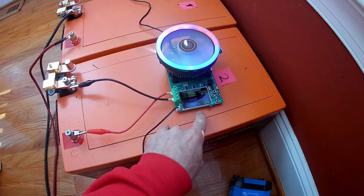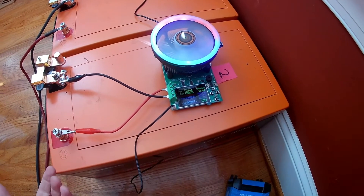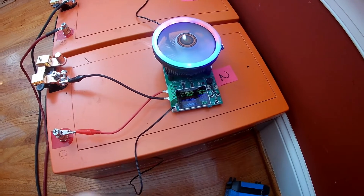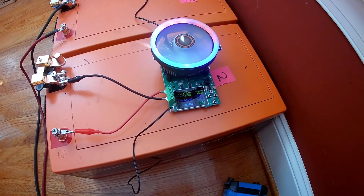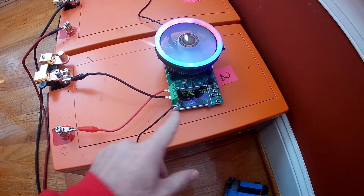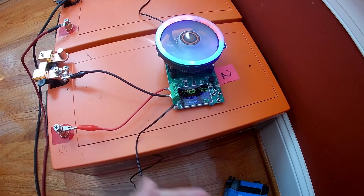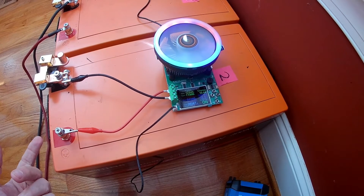This is battery number two and I'm just about finishing draining it — I'm up to 267 amps, meaning at 270 that is 90% of the capacity I've used. My current voltage is about 12.54. Which means there's really no reason to go below 12.5 volts, and your inverter and backup generator will be happy as well.